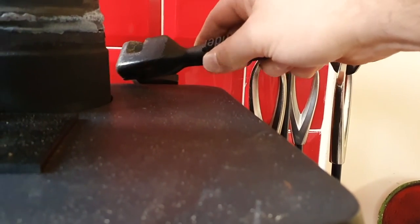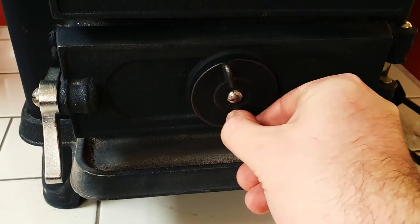To do that, I'm going to close off the secondary air supply. The downside is that it's going to make the glass soot up — that's just a side effect. You can keep it slightly open just enough to keep the front glass clear. However, I personally found I'm getting a much better burn if I close it off fully and just accept that I'm not going to be able to see the fire. That then allows me to put on a couple of turns on the primary air vent, allowing a very small amount of air in. Having set the controls like this means I'll have a good burn for the majority of the day.